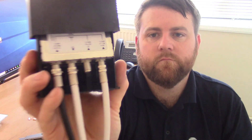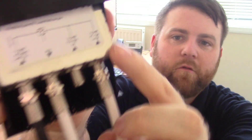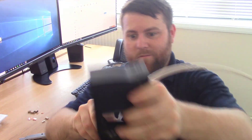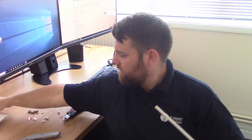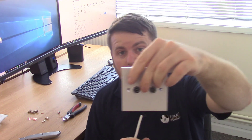With this one, you can see we've got an FM signal going in there, we've got a TV aerial going in there, and then we've got them both leaving on the combined cable, which will keep going all the way to the room where we can install our triplex wall plate. Since there's no satellite going into this one, we just ignore the satellite side — or we could get a TV and FM socket, as long as it's diplexed and not a two-input one.